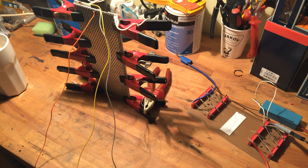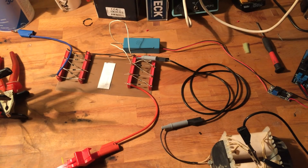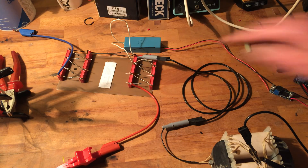I said tension is not so important — well, it is in fact important. Not for the resonance, but it is important to keep the mylar stable in between these metal plates. Usually it will tend to stick to one of the sides. And because the whole thing is not insulated, if I crank up the voltage on the BIAS, it's easier for it to jump to one of the stators, depending on the music or whatever you feed it. So that's the whole high voltage thing.